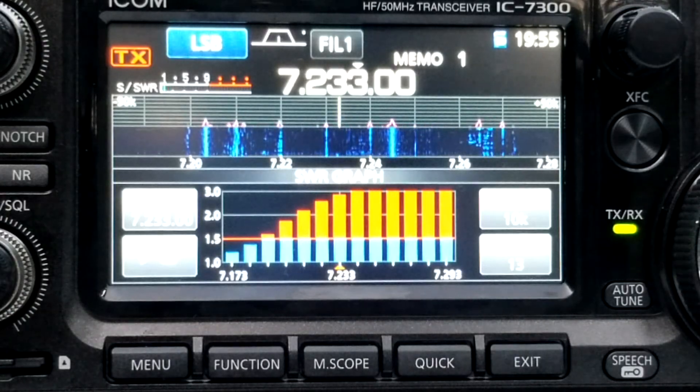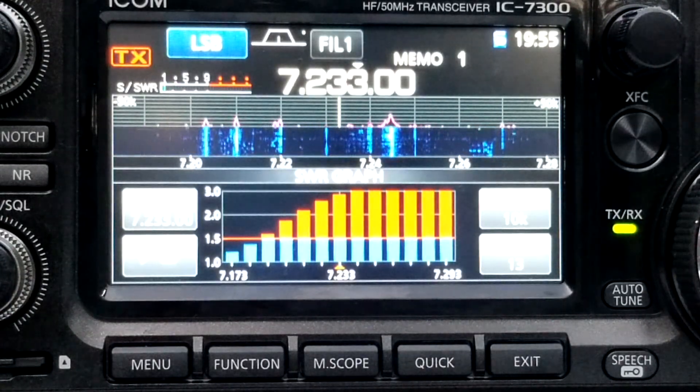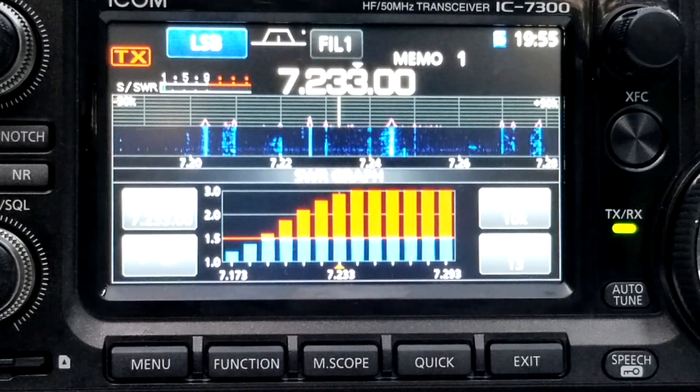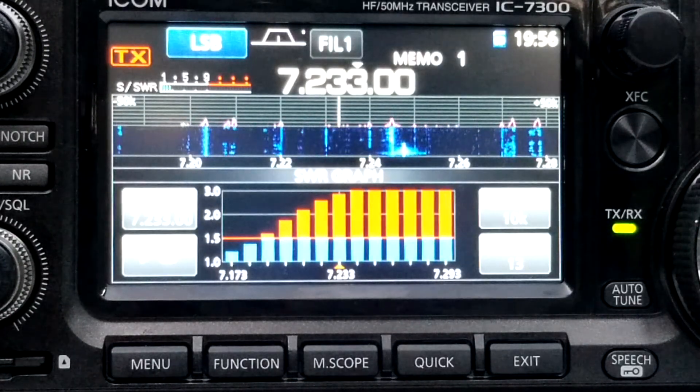As you can see, I've saved a little bit of time here. I've already run the scan and we did, in fact, shift it to the right — not enough, but we're getting so much closer. This is exactly why you need an SWR antenna analyzer. Out of the box, where the stingers were wasn't good enough. Let's make another adjustment and we'll be right back.